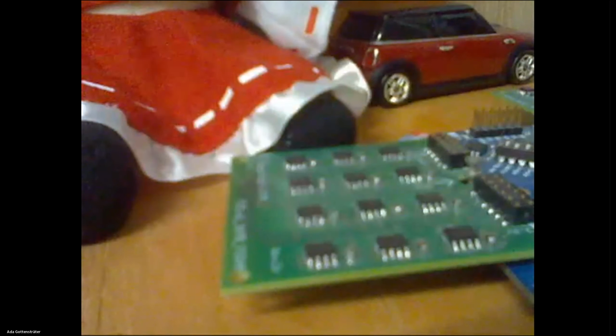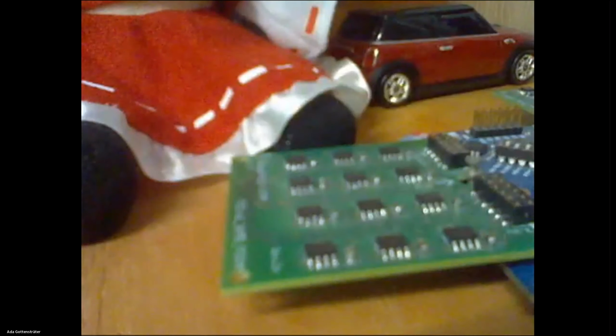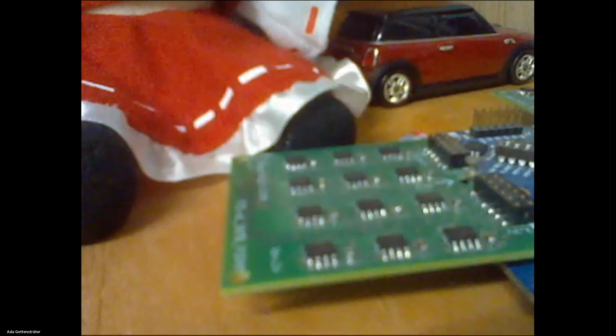So they split it into 2 groups of 3, but it technically has a 4th slot that's unused in each port. But instead of just doing that, they now have 2 ports with 2 channels on each. And some of the other registers are different between the ports. I think one of the ports has the SSG registers, and the other port has the sampling registers. They mixed it in between those ports. Now you go mad because control registers are everywhere.